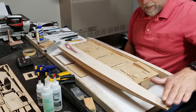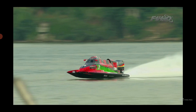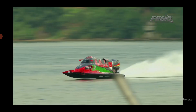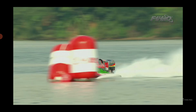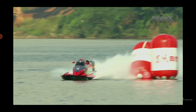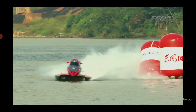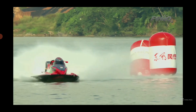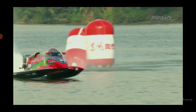That is really accurate and even — I'm sure this is intentional. Freeze it right there: he makes a slight turn to the right, to the outside of the turn, which causes the right sponson to slightly raise. Then lets off the throttle to settle the boat into the turn, and now the inside left edge grabs more water. The point of showing this is that having those angles the same from the end of the ride pad all the way to the front will cause the boat to turn the same to the left and to the right.